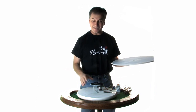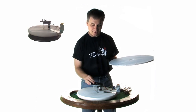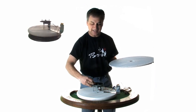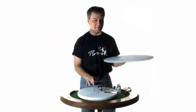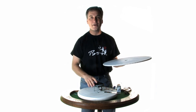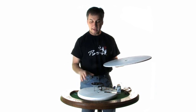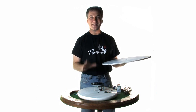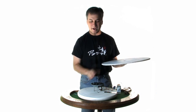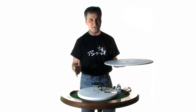For rotating the disk, there's nothing more to it than an electric motor — in this case, a little DC gear reduction motor off a cart. Depending on the size of your disk, you'll want to be able to vary your motor speed between about 25 RPM and maybe as much as 40 RPM, depending on the resolution and how many spaces you've got. Putting a speed control on it and aiming for animation in that range is ideal.